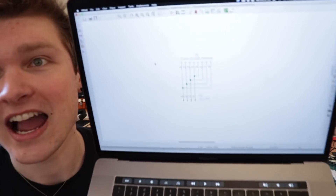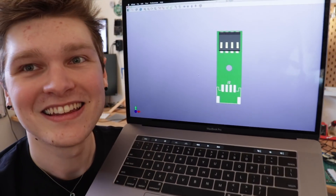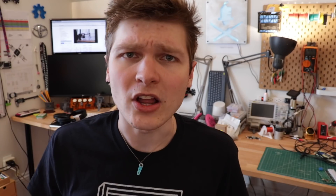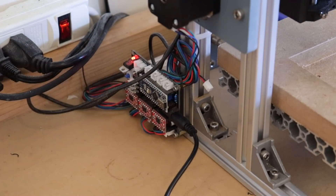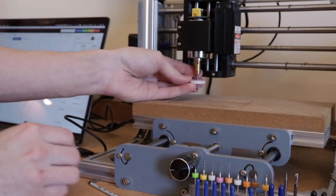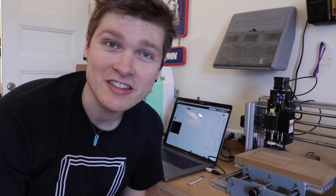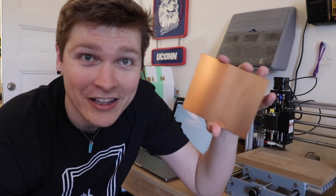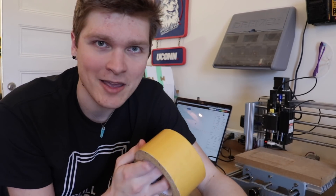This is literally the entire schematic, and this is the actual board — it's so tiny! I use copper clad blanks for milling these boards; you can get them on Amazon or eBay. It's a little rectangle of FR4 fiberglass with copper on one side. To hold it down I use carpet tape — super sticky, holds the board down no problem.